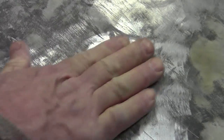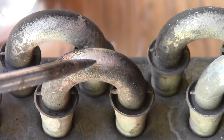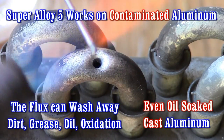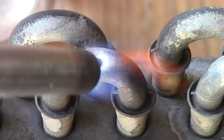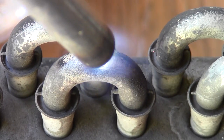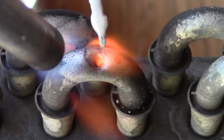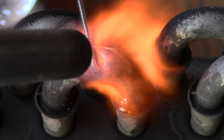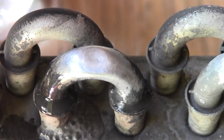Super Alloy 5 is the brazing rod and flux you need when working around and over the rivets on these aluminum boats — it can do what MIG, TIG, and arc welding cannot. We did not pre-clean this dirty, oily aluminum part to show you how well the flux works to remove contaminants. Use the torch to apply the flux; the flux turns watery. Heat your rod and parent metal and you're done. When the rod flows out, the flux is washing away years of dirt, oil, and contaminants from this old air conditioning unit. We do advise cleaning your aluminum before brazing — we just wanted to show you the worst-case scenario.